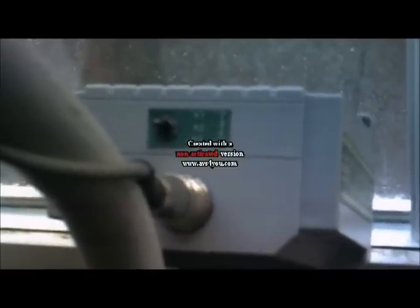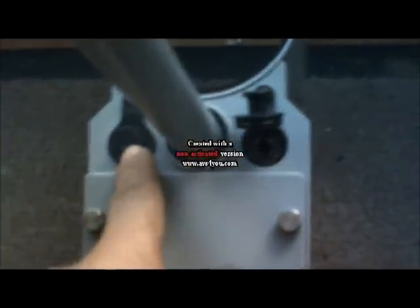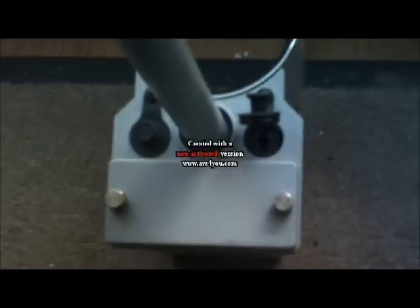On the very back of the control box you have a three position switch with the numbers one, two, and three. You normally run on two, which is the centre frequency — it's a 12kHz machine. But if there are other detectors running on that frequency you can go to frequency one or three, which allows you to operate without them interfering. Also right at the very back where your arm cuff is, you've got your batteries — 6 AAs which go in here. This is your earphone socket, and you can actually put a rechargeable battery pack in and plug your charger in to charge it up, but unfortunately mine never came with it, so I just run on normal batteries.